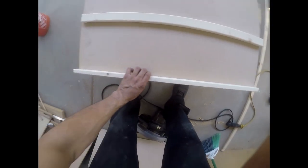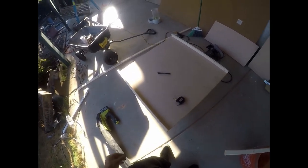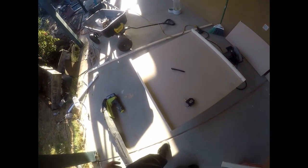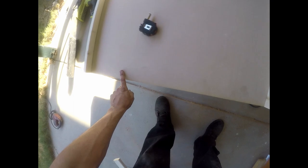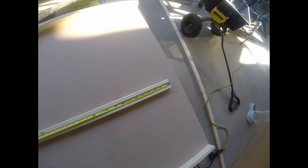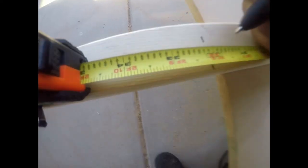So these are going to go on the edges like so, and this one's going to go on the other side. Then we're going to screw these in. It'll be stronger if you glue it and also screw it down — you could use nails, you could use screws. I'm using a nail gun with a compressor, which is a lot faster. The next board is going to go in between these two here, which would equal 32 inches. So we're going to cut two more of these at 32 inches a piece. We're going to go exactly to 32, make a line, and cut two of these.